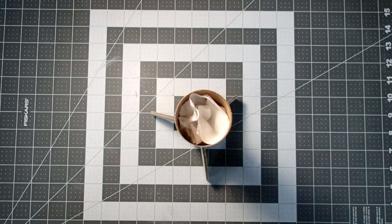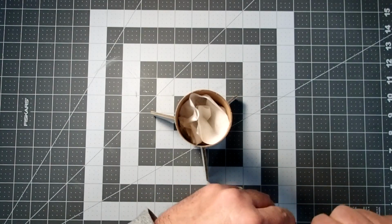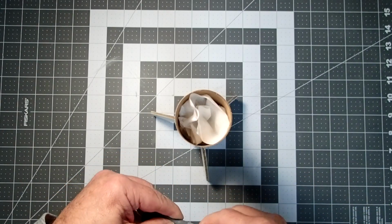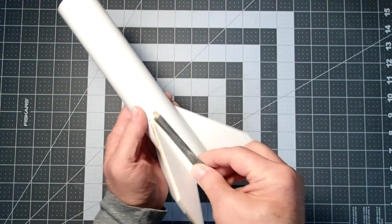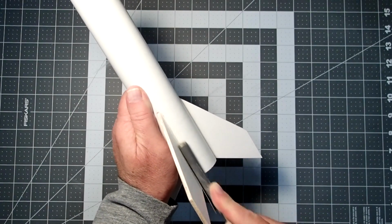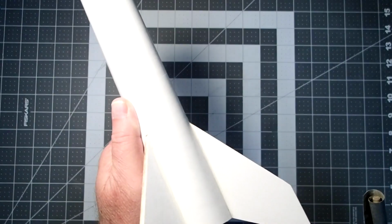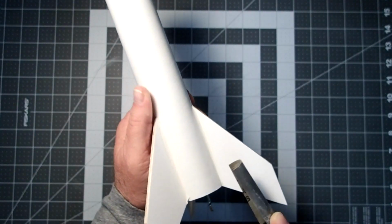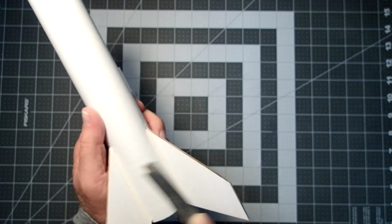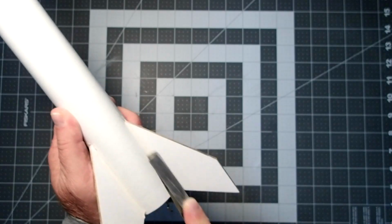The contour putty on my fillets has dried, and I'm going to take some 400 grit sandpaper here. I'm just going to roll it over a dowel, and I can use that then to sand those fillets here, at least initially. Okay, now that one buckled a little bit, and I think it's because earlier I tried to do this and it was still a little bit wet. So I'll probably go ahead and apply a little bit more there. So I'm going to go ahead and sand these all around, and then we'll take a look at them.